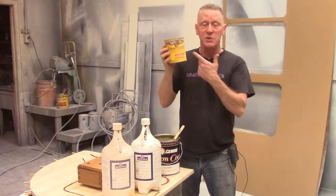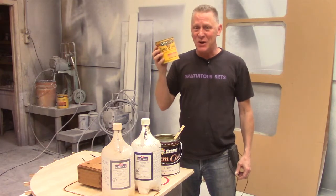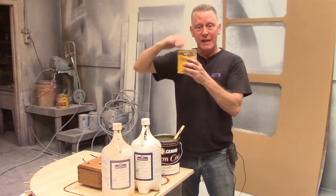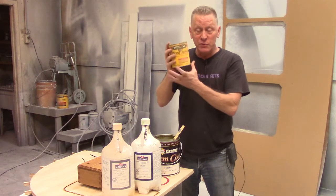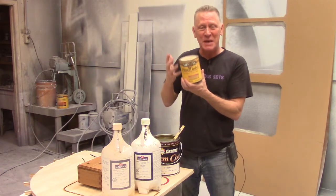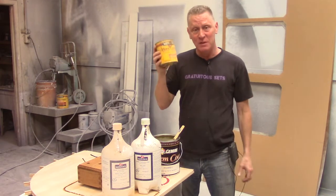This is stain. Now this one is natural and this stuff we do use. The stuff that has color in it though, we try and stay away from, or we'll mix a tiny bit of a colored stain with natural and make a very low tone variety. What this is good for is bringing out grain, and that's what they tell you it's for. The problem is that the pigment that's in it is giant. They're giant particles of pigment and they look terrible on it.